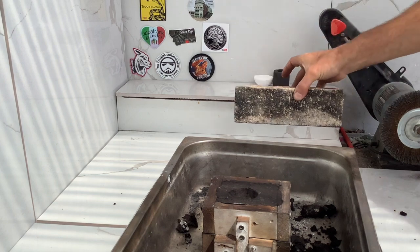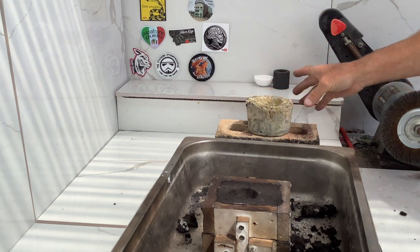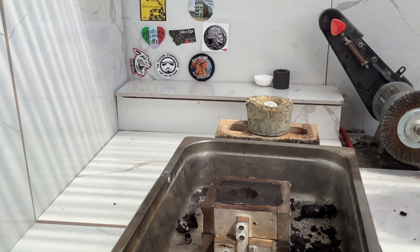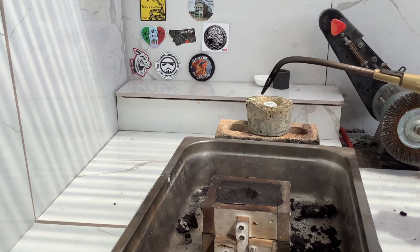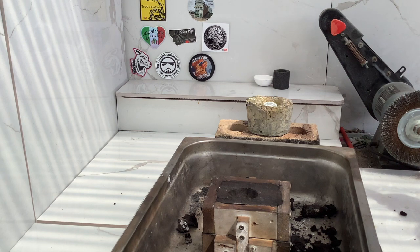I'll put this brick in here — that'll just give me a bit of height to put my crucible in. There's the crucible. We'll get some four nines fine silver coins going. I'm going to get the torch going — I'm just using an oxy acetylene torch. To me it works the best; it melts the metal down quicker than anything else. I'll get the metal prepared and then turn it back on again for the pour.